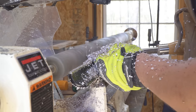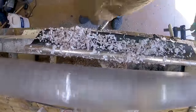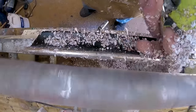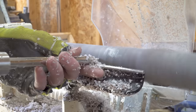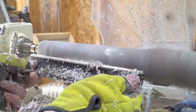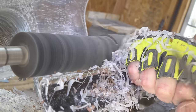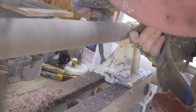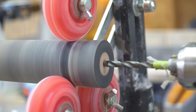Turning these epoxy blanks, especially the longer blanks on the lathe, just takes a long time — this is not a process you can rush. To start building in things like the taper and install the joint pin, you really need this to be a nice cylinder. I like to use a steady rest to hold the blank while I install the joint pin, then turn the joint pin as the center. I found it easiest to use a square carbide tool and move in a sideways fashion super slow, taking off small amounts at a time and working down the length of the blank, before using some pretty heavy grit sandpaper to smooth it off.